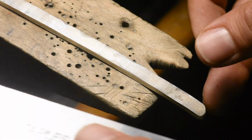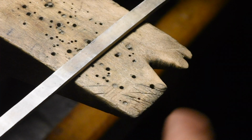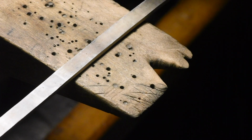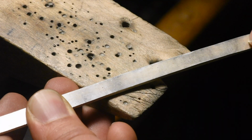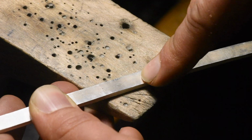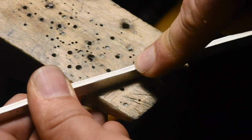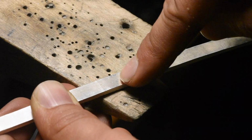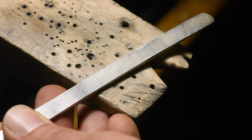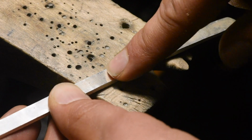I'm just going to hammer it. It will get that 1/2 inch extra drawn out, because as I hammer down the line here, it's going to draw it, and it's also going to splay it out widthwise. It's also going to make this thinner, right? So those are the 3 things. If I just keep hitting it here: wider, thinner, longer. And that's what we want. And then I'll throw the texture on it.